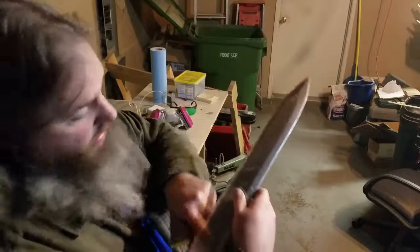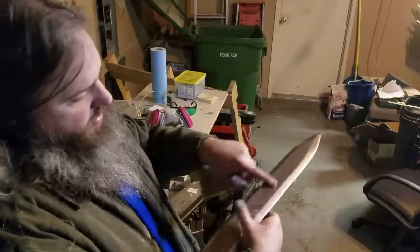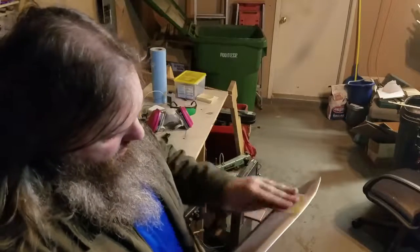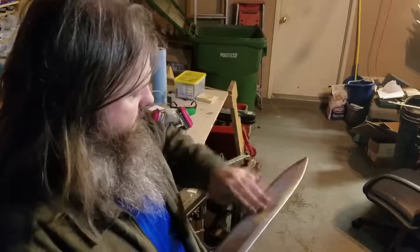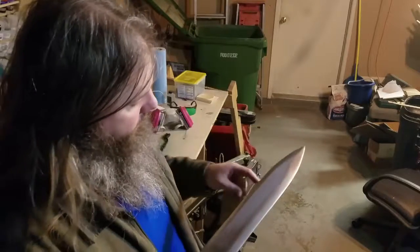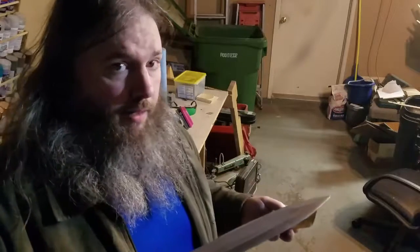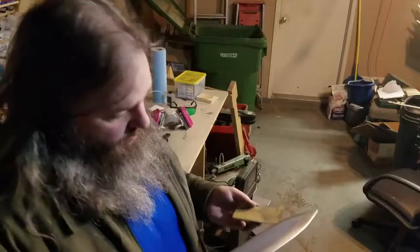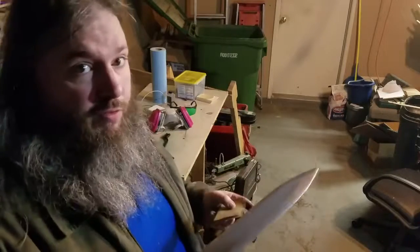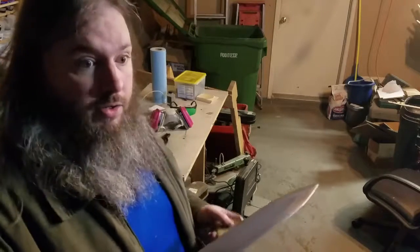All right, that's done. This side was facing down, so it didn't have that issue as badly as the other side, but there's still some imperfections. That's already gotten them out. Also, if you ever repaint the surface, you have to sand. But what I just did just there, that's it. That's all you have to do. You have to scuff the surface.